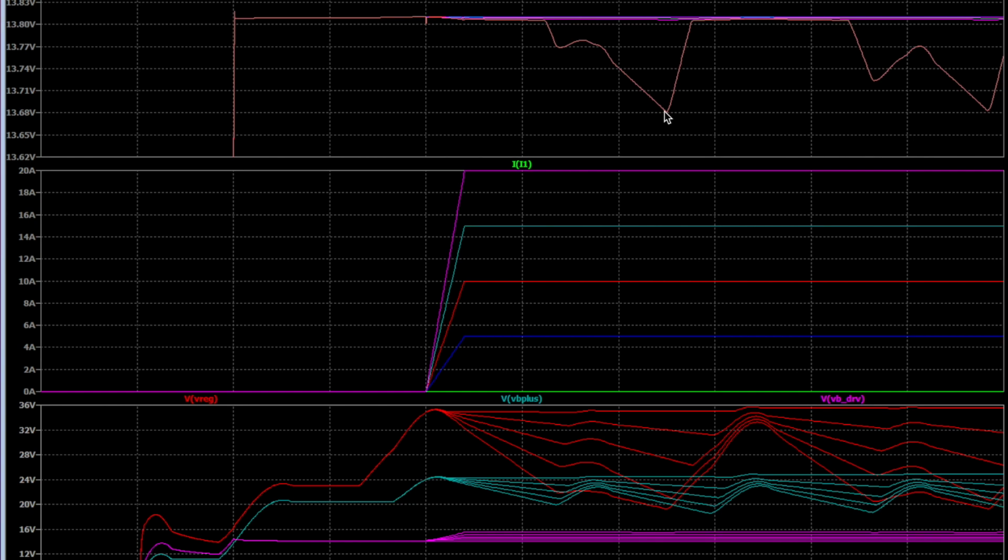In the actual instrument, I was seeing much better performance, maybe because some of the internal voltages or actual transistors that I used were different from what is in the actual power supply, so they don't match 100%. But overall, you can see up to about 15 amps, the regulation here is excellent, barely 5 to 10 millivolts across all these currents. And so the main thing is that we can simulate this circuit and observe everything inside if we model this correctly or do the schematic and use the components that are appropriate for the simulation.